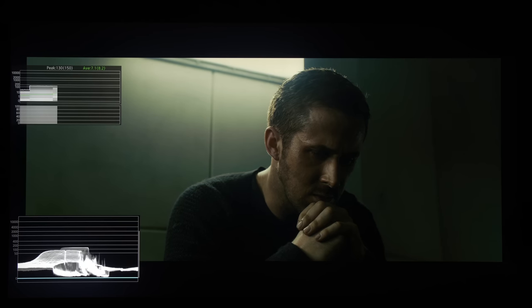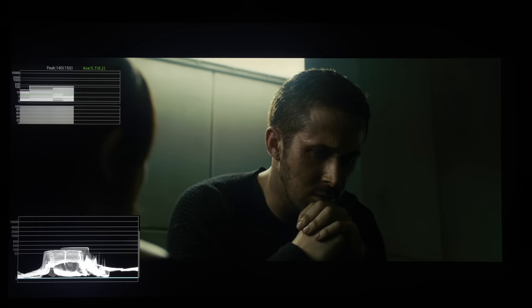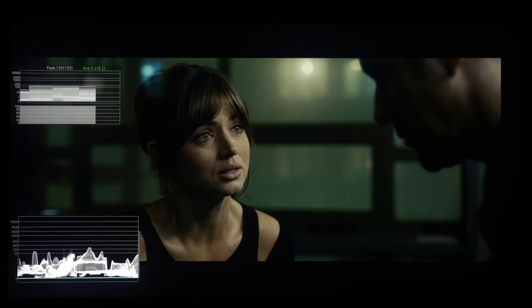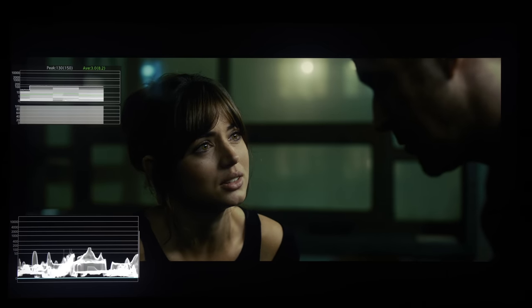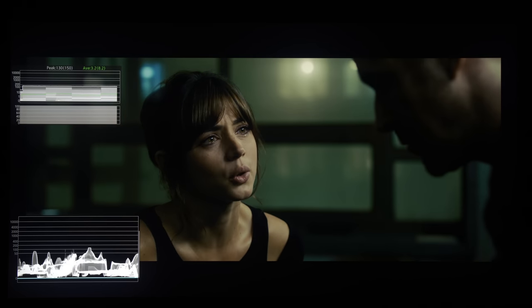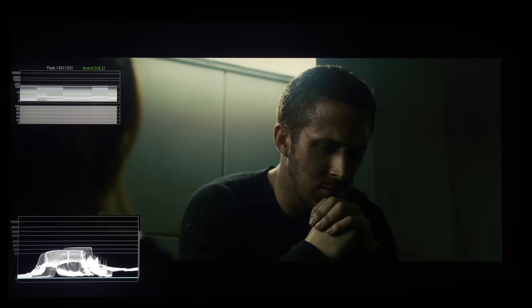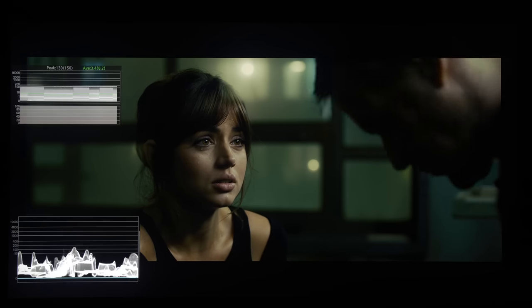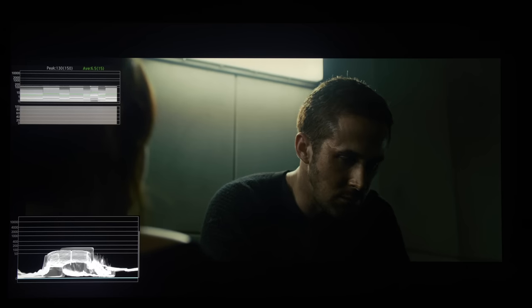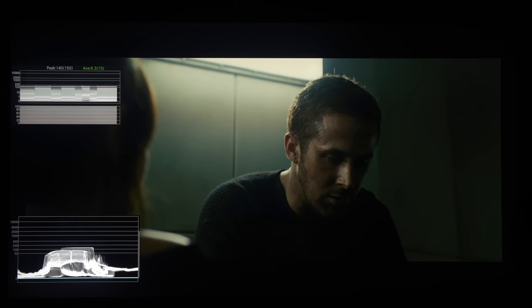Here, at the top left corner, is a frame luminance monitor. This will track and jot down the maximum luminance, or max CLL — peak means max CLL, which is maximum content light level. The bracketed figure inside is the maximum that has been recorded throughout the duration until you press the reset button. The average would be the max FALL, or maximum frame average light level, and again, the bracketed figure is the maximum recorded throughout the duration.